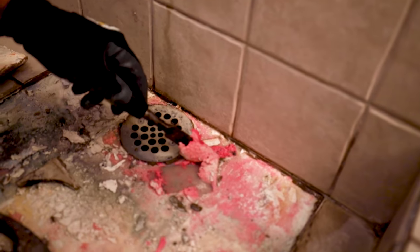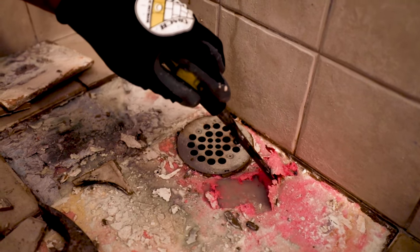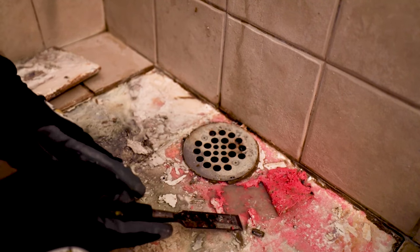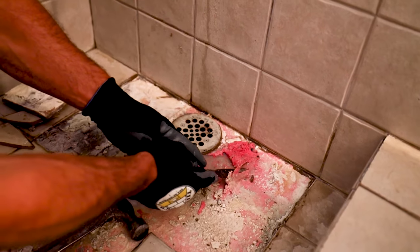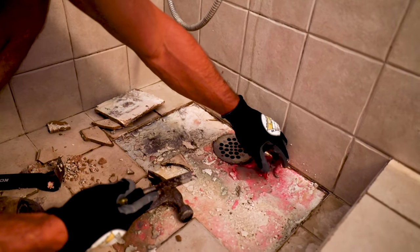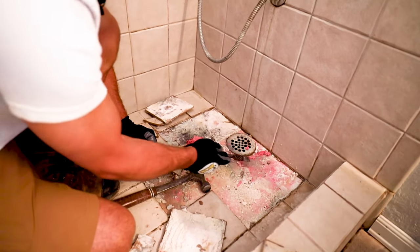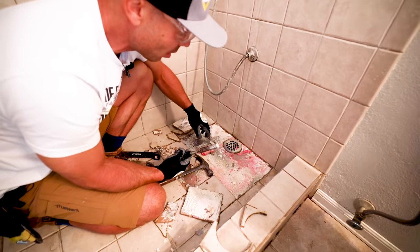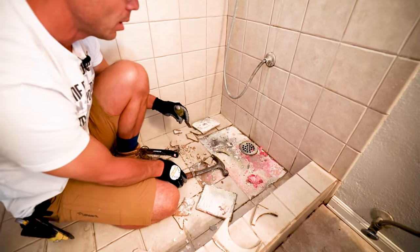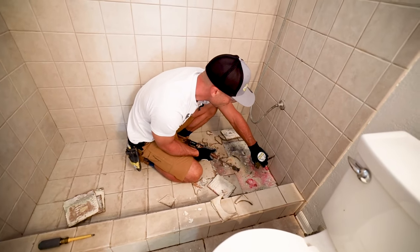Here's the Red Guard after 20 years of being down. Luckily we're on a concrete foundation here, or else this would have been a lot of trouble, because there's no effective waterproofing left from the Red Guard. The water is still standing in a pool because the concrete is holding it in. Let's see what's happening on the walls.